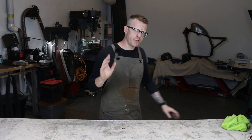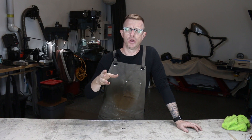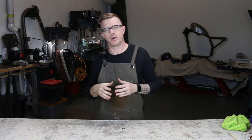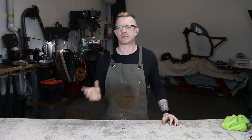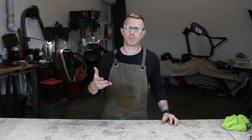We're going to set it up right here in this shop. I'd also really like to start plasma cutting my own knife blanks and selling knife blanks as well. If you're a knife maker and want a bunch of the same design punched out of 1095, 80CRV2, or whatever steel — you send me the CAD file, I'll lay it out on a sheet and cut out 10 or 20 blanks at once. I think that could be a business that pays for itself. A lot of guys sell knife blanks, but there are concerns about steel quality — if you buy through me, I stand behind what I'm doing.